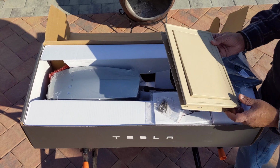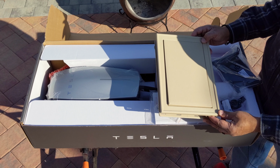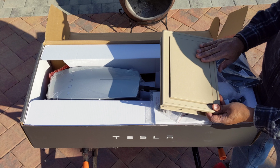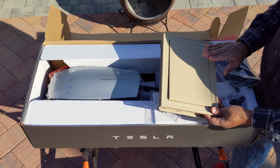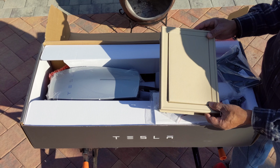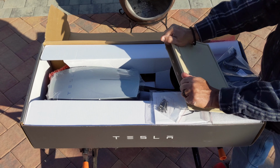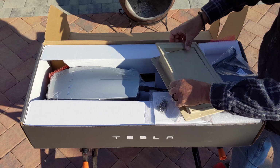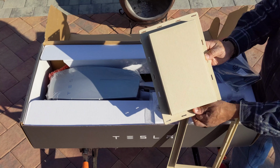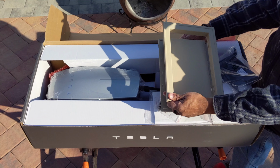I have to install this first. This is a jumbo light mount. The color is Savannah Wicker, and it matches my siding. Since I'm going to have to cut an opening in the siding wherever I mount this, to get a nice finished look, what I like about this version is that this little trim comes off. So when I cut my hole in my siding, the siding is going to run against this edge here, and this is going to give you that nice finished look.